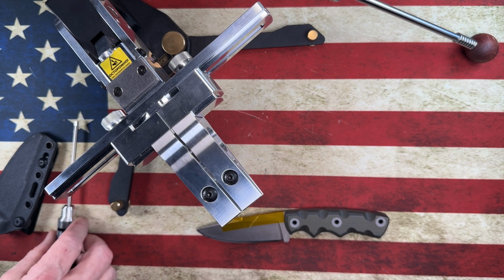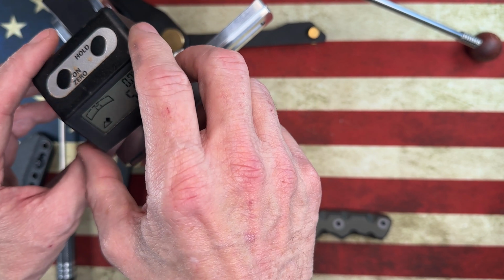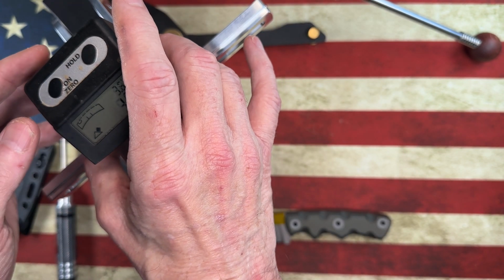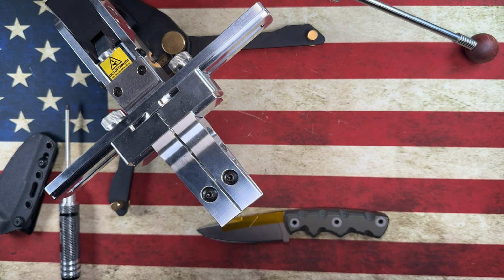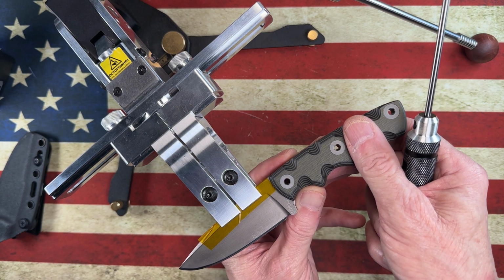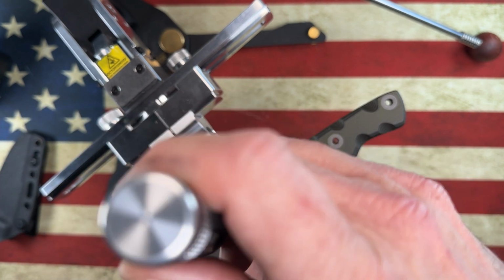because what I've got is this plate right here that I use to set my angle cube. I'm going to zero that out right there. Zeroed out, alright. So now I want to clamp in, try to parallel it to the side here, so it's parallel with my back.